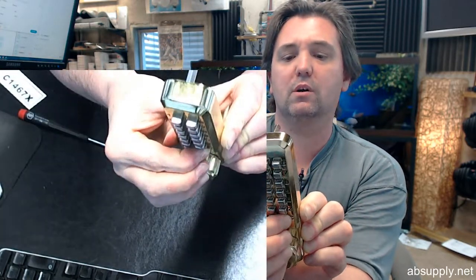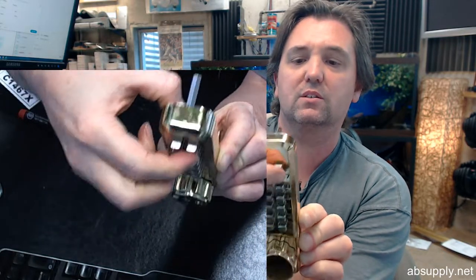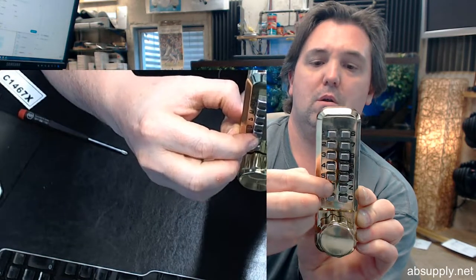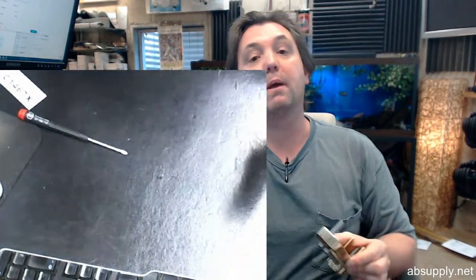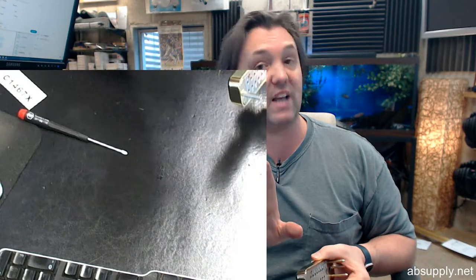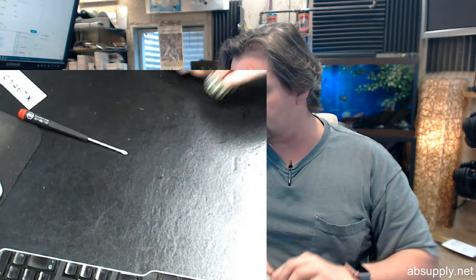That did not work. I'm pushing clear again. 1, 4, 6, 7, X. Worked perfectly. Don't know what happened the first time. Maybe the wafer didn't seat itself back down. Maybe I didn't seat it properly the first time. That's how you'll change the combination.